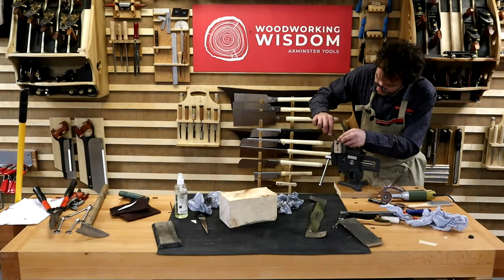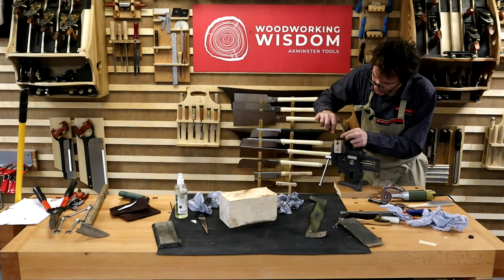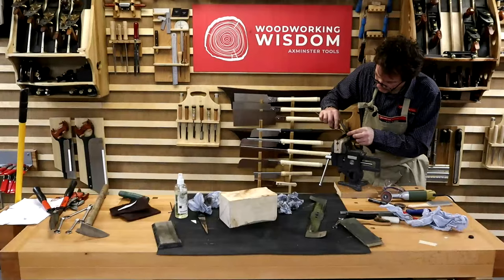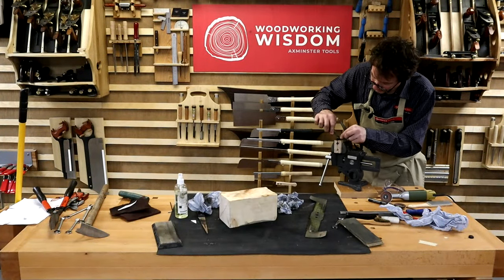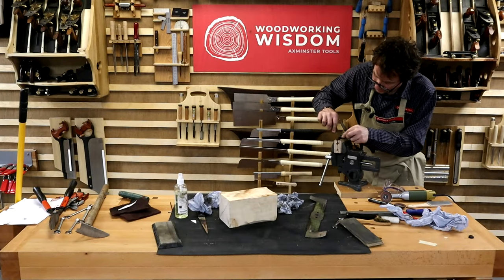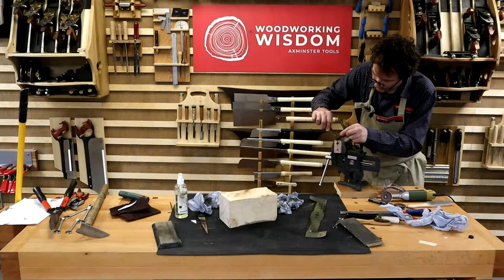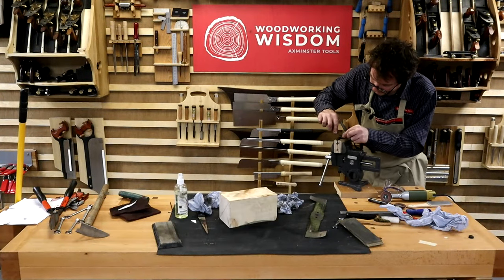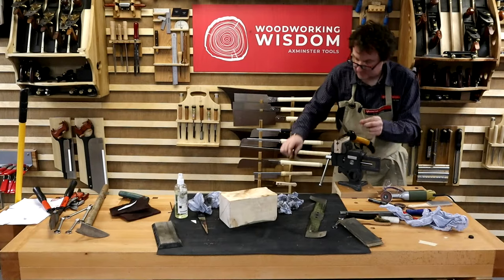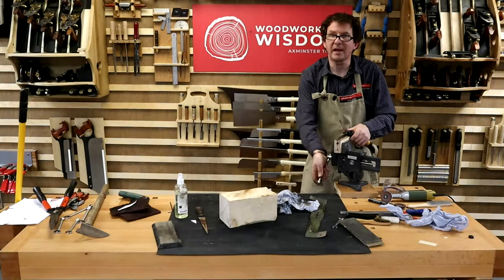Again, back in. Now you can kind of see when I've set up with the vise now. It makes this so much more controllable. I'm being able to use both hands to steady the file. I can drop onto my angle. I can feel it when I'm on here. Once I've found it, lift my hands off, come back, repeat the angle quite easily. If you're doing it freehand, you're up in the air, all over the place.